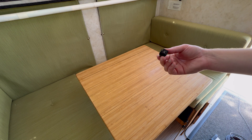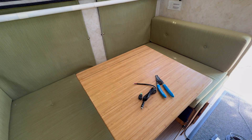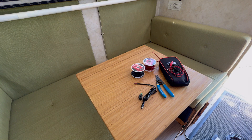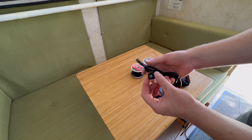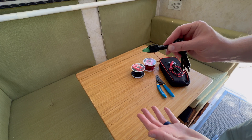I'm going to get together the supplies for the project. We have a barrel jack connector that fits in a keystone jack, a barrel connector that's the same size as the Starlink Mini connector, wire cutters and strippers, black and red 16-gauge cable, a multimeter, and some alligator clips so we can test the voltage and make sure everything looks good before we connect the Starlink Mini. The barrel jack will go in the exterior connector and the Starlink Mini's cable will plug right in.